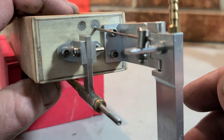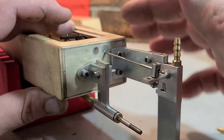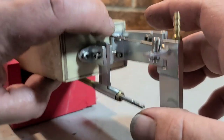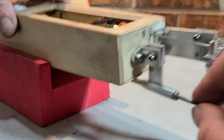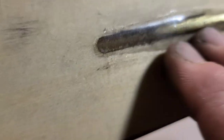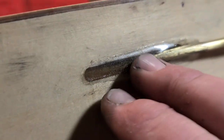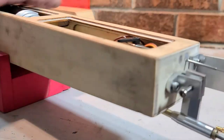Boom! Looks good, right? I got the transom all cleaned up, sanded, the through holes cut flush. I got my stuffing tube mounted up. The epoxy's all done drying inside and out. All I have to do is sand it to shape, do my final sanding. It still needs to kick off a little bit more before I start sanding on it.